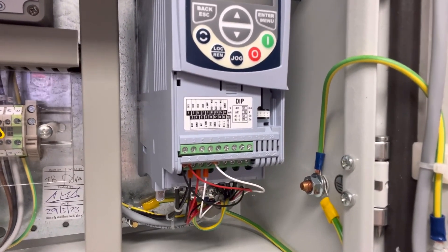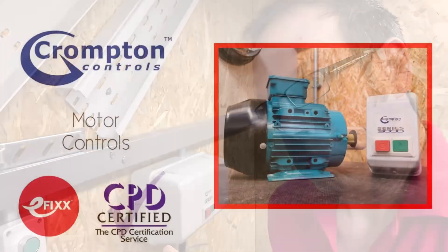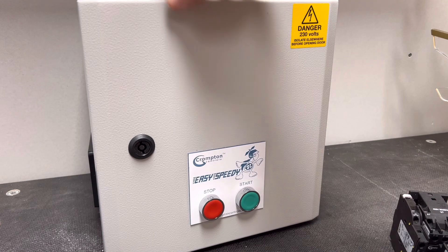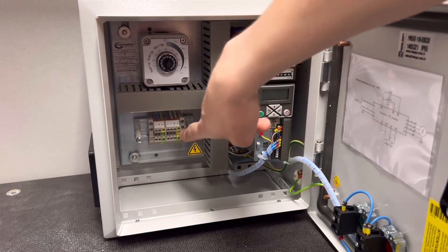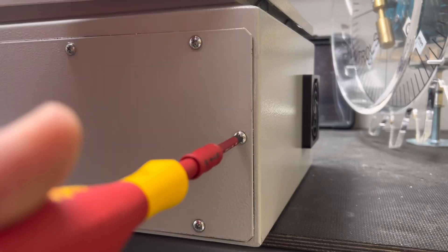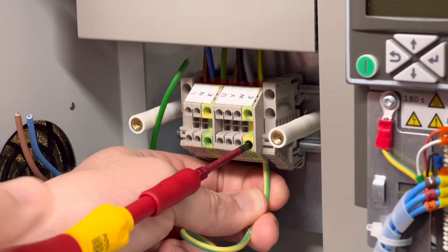For a lot of electricians, as soon as you start talking about variable frequency drives, they come out in a cold sweat with the thought of inputs, outputs, controllers, programming, and so on. We've actually created a free training package with Crompton Controls on this very subject to help you with your CPD, and you'll find a link to that in the description. But that's really where the beauty of this product comes in, because it's really simple and it's all contained in a single housing. You've got the inverter, the speed control, the start-stop functions, and all the connection terminals in one convenient enclosure. From an installation point of view, all you've got to do is bring in the supply and the cable to the motor. You can remove the top and bottom plates for easy drilling and glanding if you need to, which helps prevent swarf dropping into the inverter and shorting out critical components. Then all you've got to do is connect them into these handy labelled terminals.